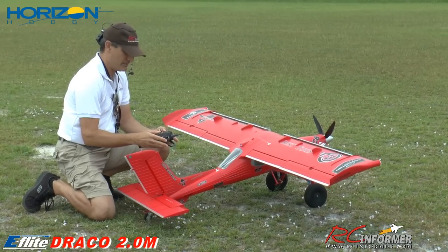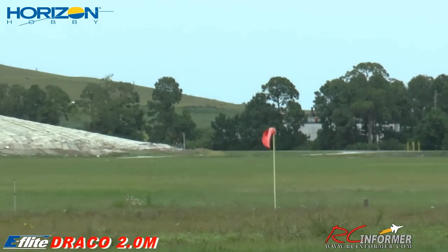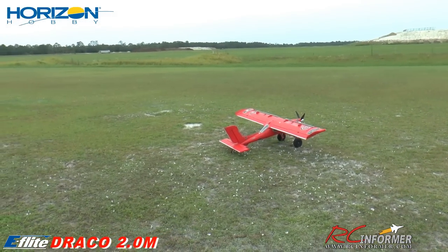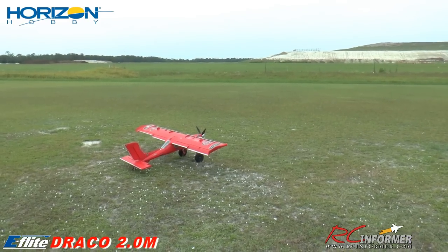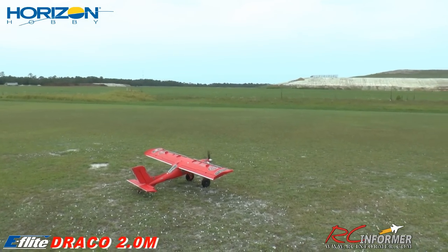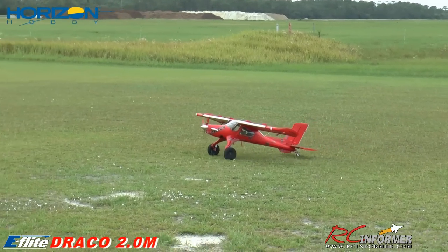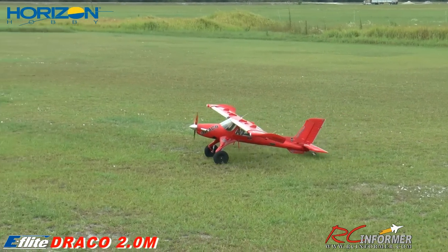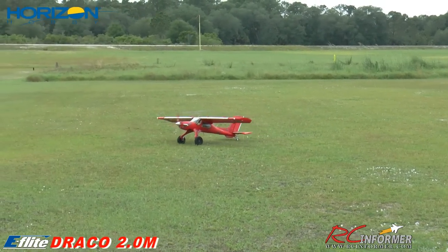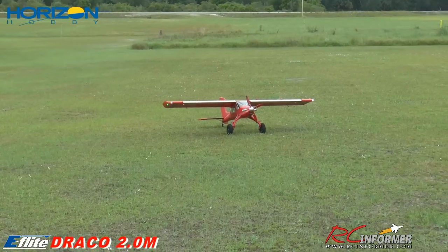Without further delay, I'm going to go mid rates on everything. It's very windy — Steve, if you want to get in on the windsock out there, show everybody what it's like. Rather than doing a crosswind takeoff, me and Steve are going to go into the wind. I'm going to taxi it around a little bit. Huge tires, folks. This airplane's tail wheel is semi-directly linked to the rudder but set up with springs, so to steer it you've got to use a little bit of thrust over that rudder. Also, notice the prop brake is on — it's set up for the reverse thrust feature.